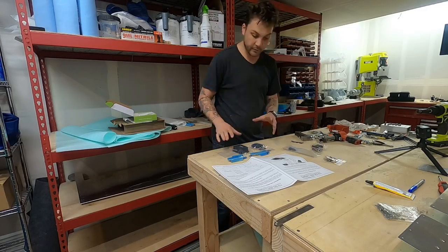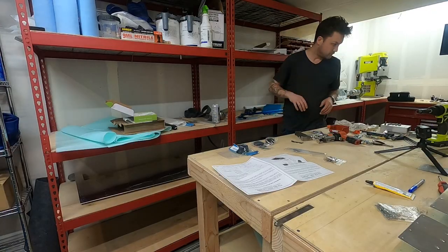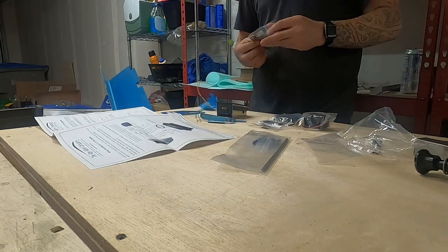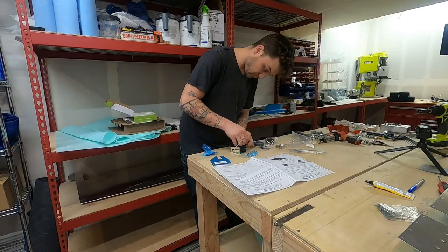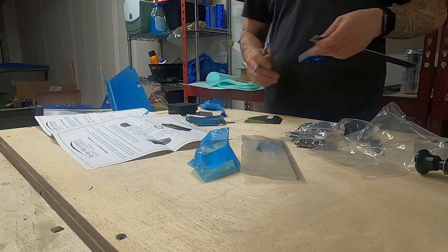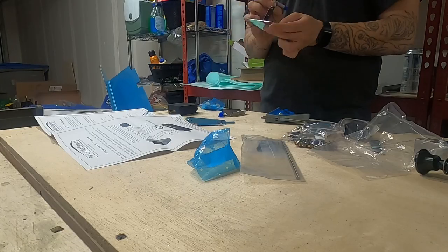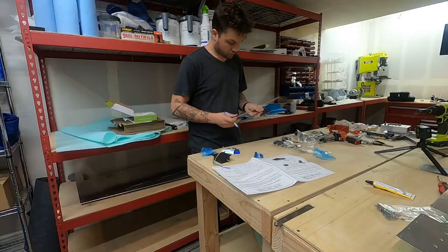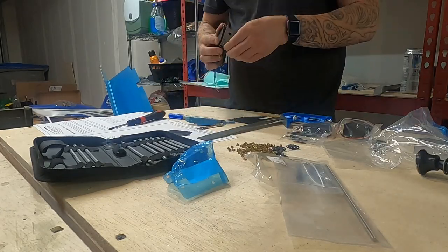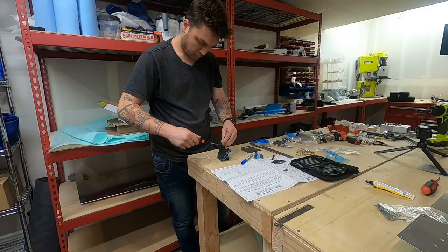The electronic trim kit allows me to adjust the trim via a button on either the dashboard or my control stick, or even both. The kit seen here includes a servo motor, buttons, indicator lights, brackets, and a ton of hardware. It was a little overwhelming just going through it, but it was necessary to dry fit everything and see what would be required in order to get it installed. Many of the pieces would wind up needing to be primed before I could take the installation any further. In fact, going through this wasn't really required in order to close up the elevator, but it was helpful to get an idea of what was coming up.